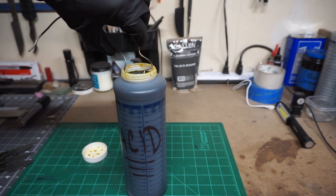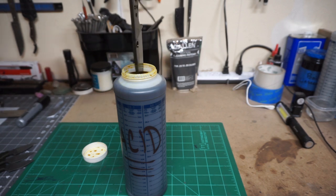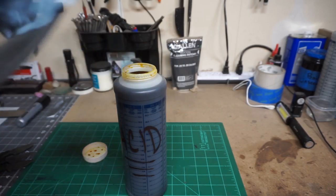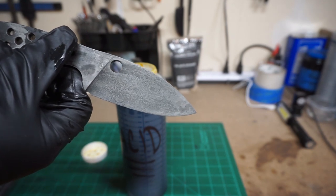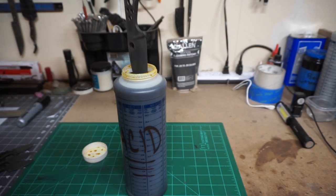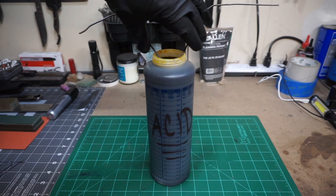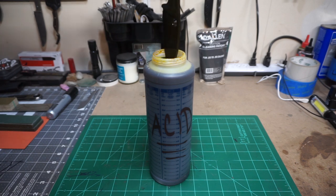This is just the first phase — I do two phases of this. The first one eats away the rest of the forge scale and contaminants on the blade that I was using to put the pattern in. Once we clean all that off, we go ahead and do another 15-minute dip in the acid — so the first one was 15 minutes, this one's going to be 15 minutes as well. This second one actually makes the blade a little bit darker and really solidifies that texture that we wanted.